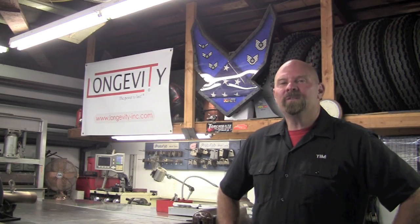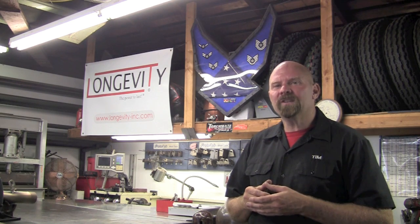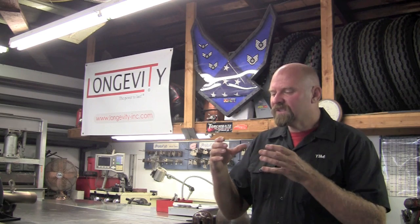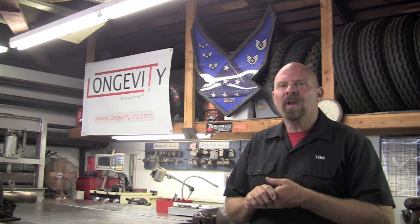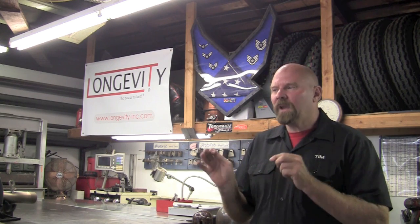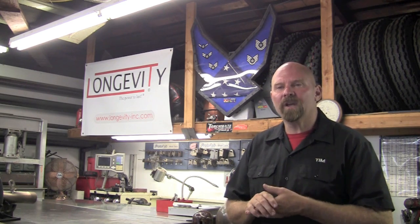Stainless steel has welding characteristics somewhat like carbon steel, except it has a slightly different thermal characteristic. It tends to stay localized, and there are a few things we can do to take the heat out — we can run heat sinks, keep a nice tight arc length, and try to run just the minimum amount of amperage to get the seam done.